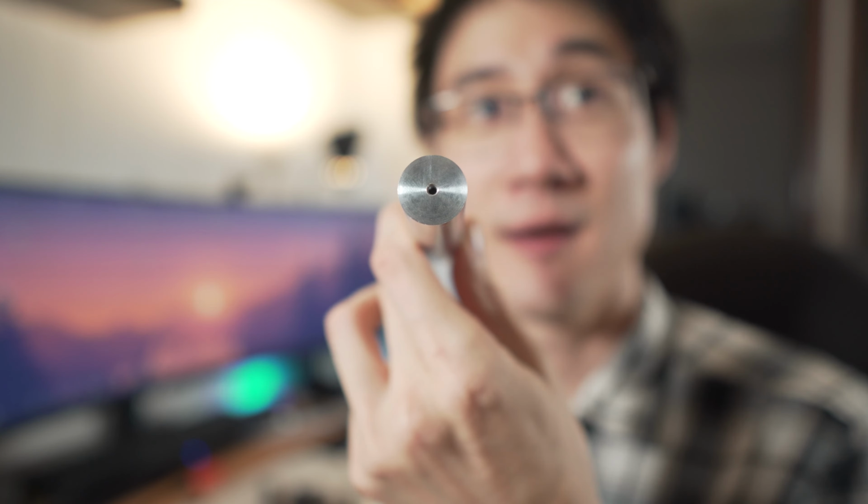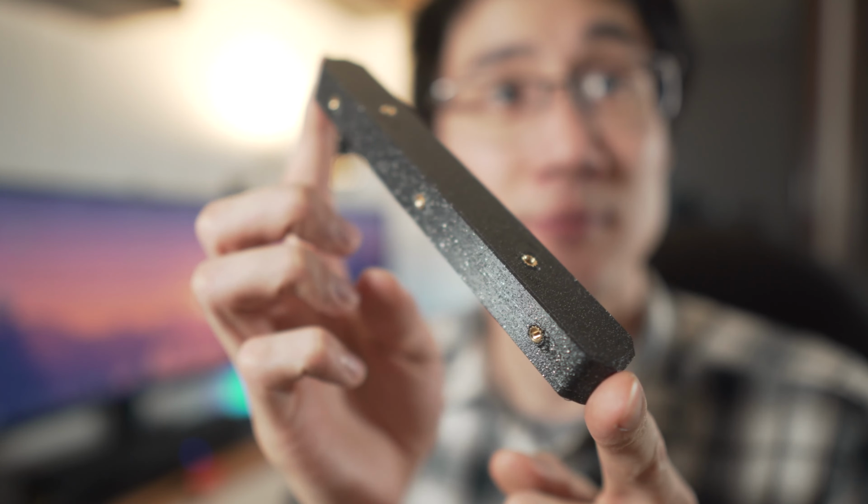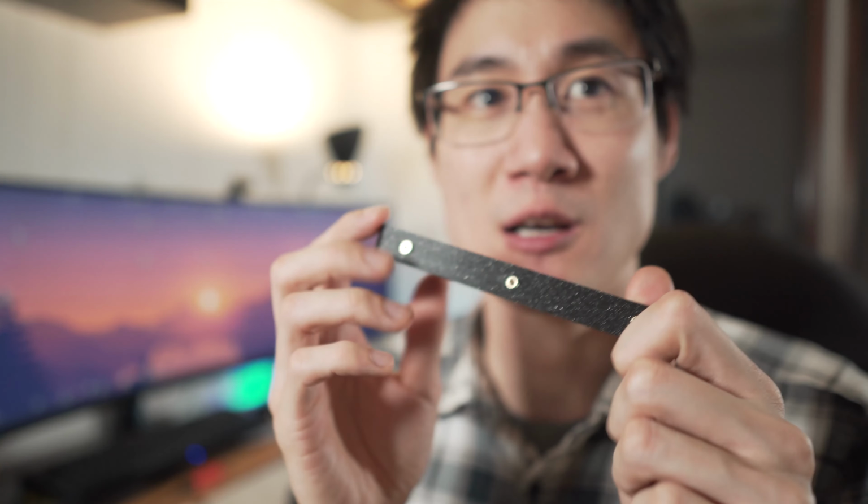Okay, I'm gonna put the camera on. I'm gonna throw all these parts together. We machined some aluminum feet. Simple design with a single M3 tapped hole in the back. And this is what I'm talking about. A 3D printed part. Brass inserts. Because I don't ever really like tapping directly into plastic. Something just feels wrong about that. And these work so, so well. For what it is, why would you do it any other way?